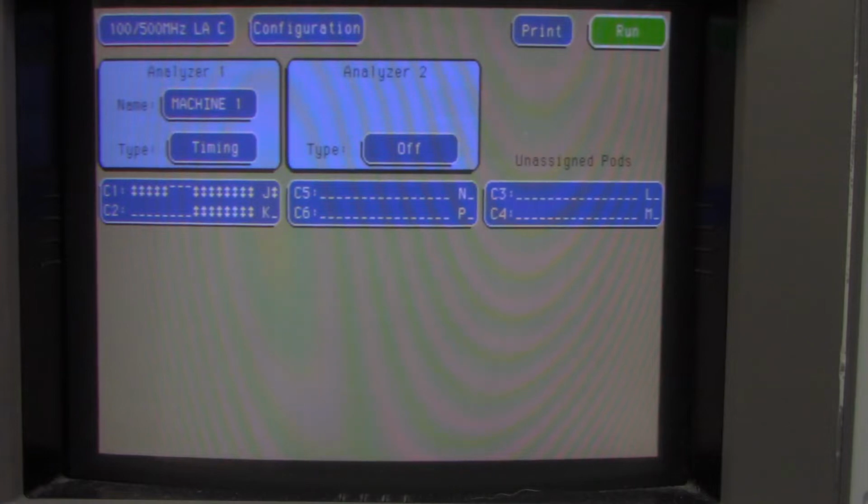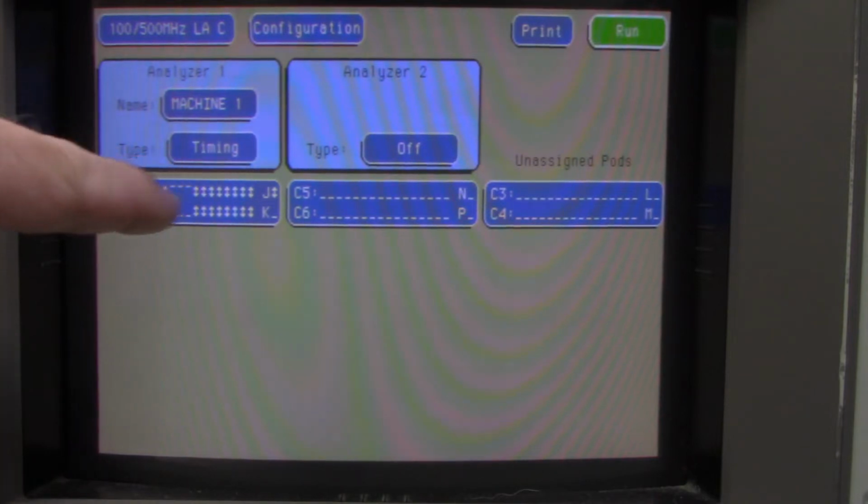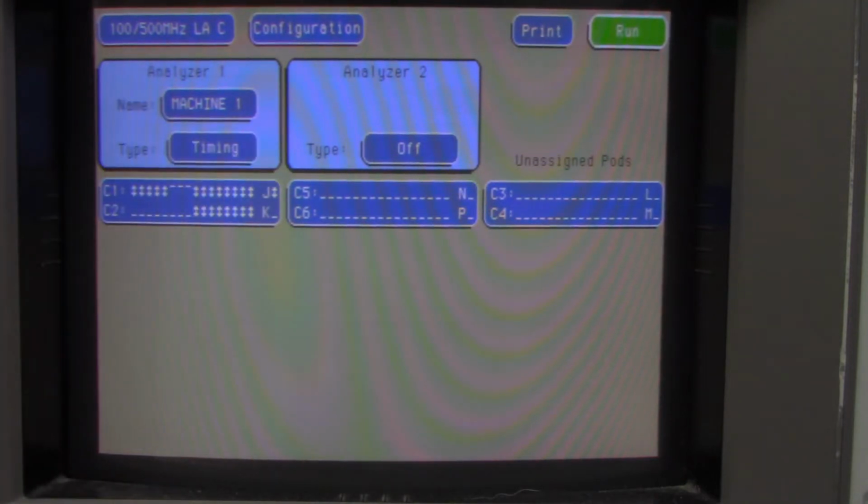So it brings you up to the configuration, and what's neat is you can see these arrows here. The arrows, when they're going up and down, it means there's activity. So I'll just type a command in, and you can see some of these arrows change. So you could see a little bit of change there, meaning that you want to see arrows on all your lines. That means that it's connected. If your system was powered off, say, all those arrows would go away. So that's a good troubleshooting tool.